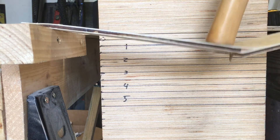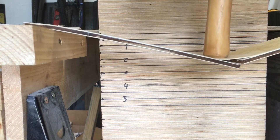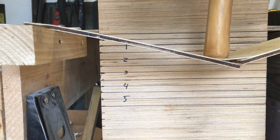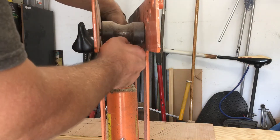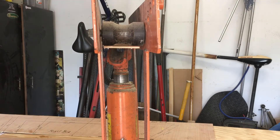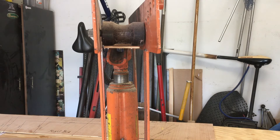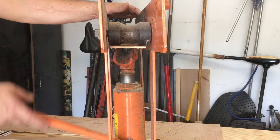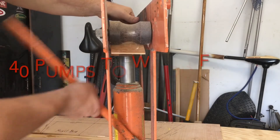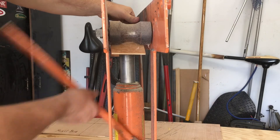The fiberglass itself is stronger than my sawhorses, so I had to redesign the test. In tension, this fiberglass is super strong. I set up my hydraulic pipe bender with a die on it and brought the wood between the rollers just to where there's some tension. By counting full-stroke pumps I can get consistent bends and test the strength of the board by how many pumps it takes to cause failure. Testing plain plywood: at around 38–40 pump strokes the wood is cracking and we are at failure.